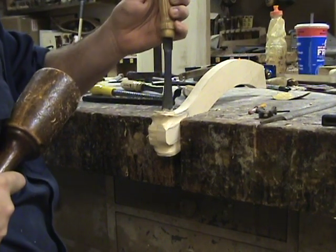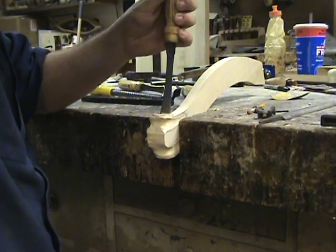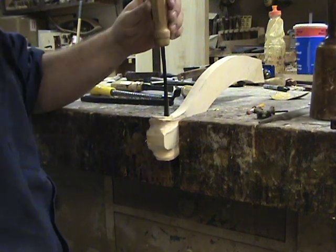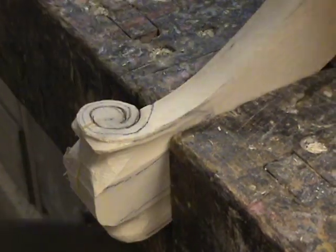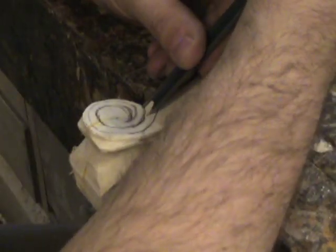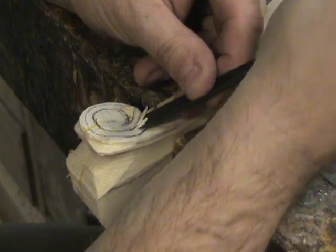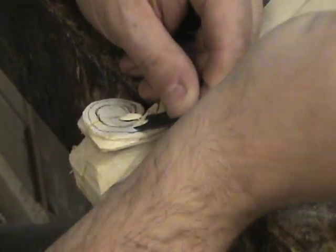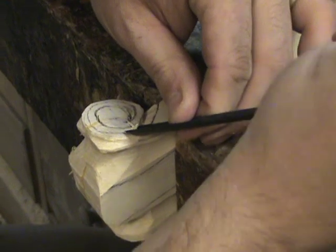Now I'm using a little bigger chisel — actually the biggest one I have. This gets up and around towards the top side, and then dead ends about a quarter of an inch away from where the block was glued on. I'm going right into it, making a nice even curve. Back to the small gouge, I start at the top pencil line and carve straight down into that stop point. That eighth of an inch or sixteenth of an inch you chiseled down acts as a stop so you can do this part.